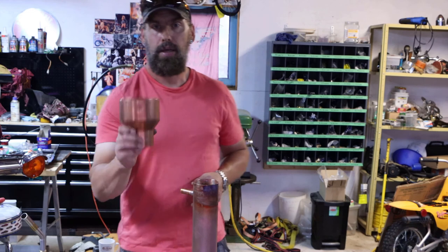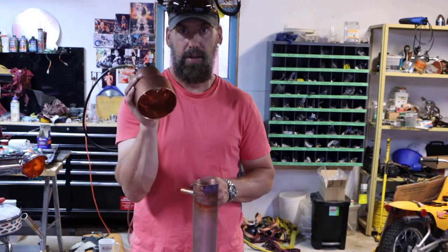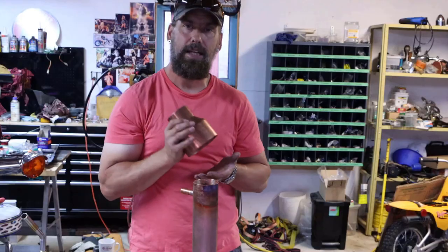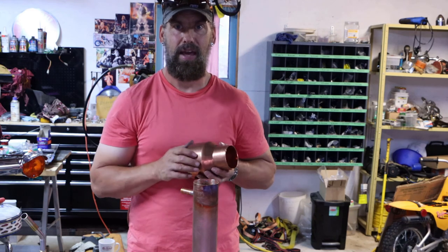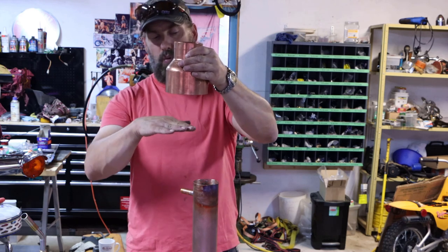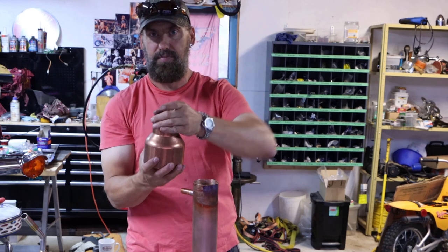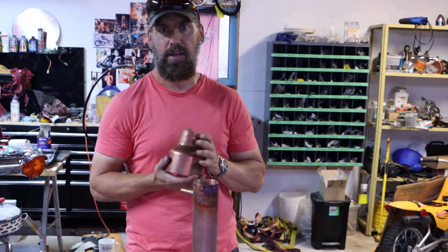At some point, I'm going to take my boiler and change it over from a 2 inch to a 2.5. We're going to switch to the 4 inch and taper down to a 2.5, because I've got about 16 inches of 4 inch pipe that I want to use to mimic an onion. Maybe 10, 12, 14 inches, put this on, then add my 2.5 inch column on top of that, then come off there and do the condenser.